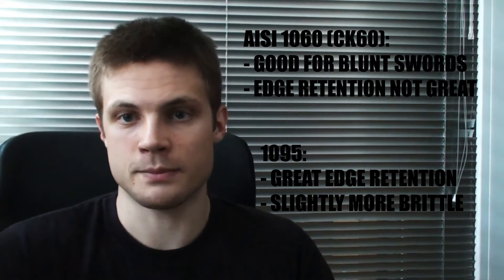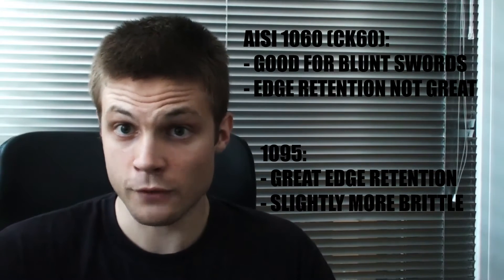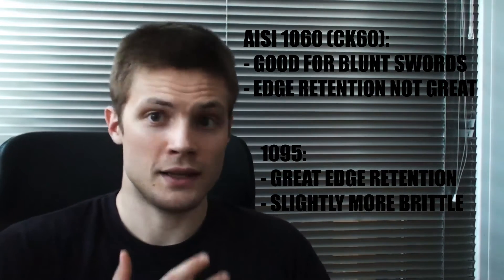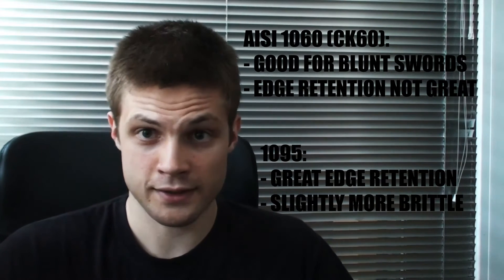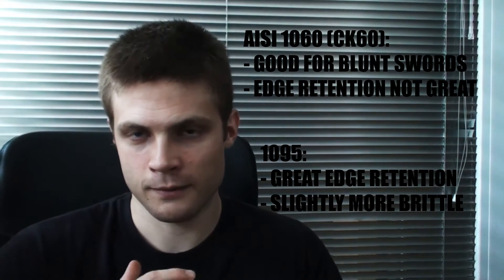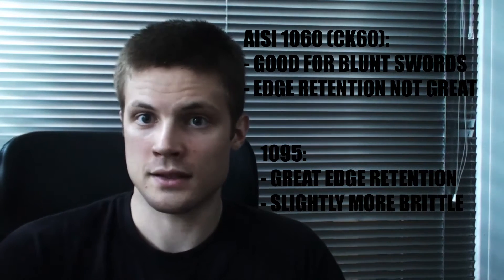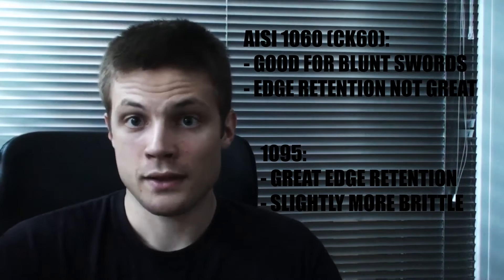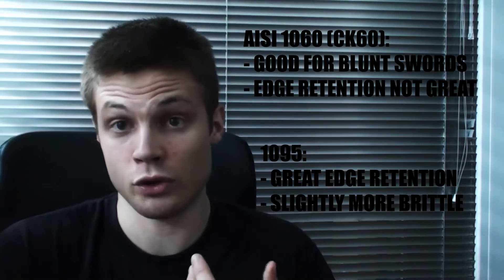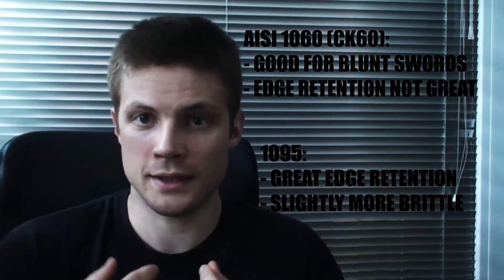This isn't a problem with sharp swords, because a blunt sword or a feeder sword will take a lot more stress in a single rough practice session than a sharp sword is likely to see in its lifetime. So 1095 is a good steel for sharp swords. Of course it has a 0.95 carbon rating, which is past the point of 0.85. That means if the steel has a carbon rating higher than 0.85, it will hold an edge much, much better than steels with a lower carbon rating. Now, 1060 can still make a sharp sword, but you'll have to hone the edge a lot more. However, it is more forgiving — if you hit something hard it is less likely to chip. It might roll back faster, but it is less likely to chip.